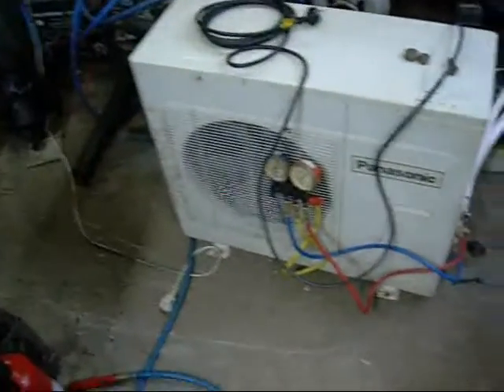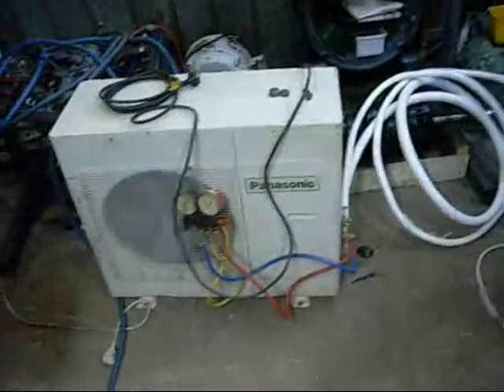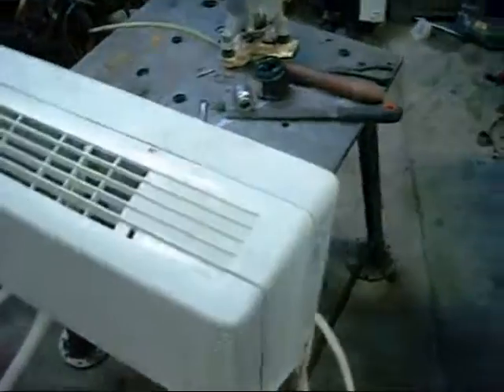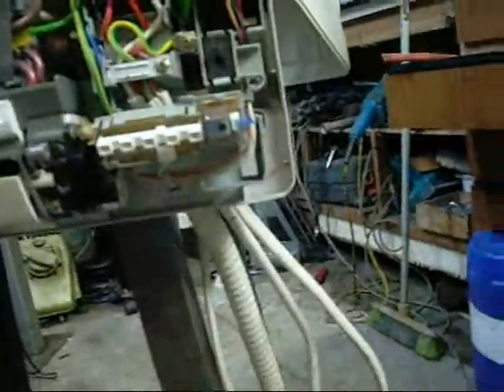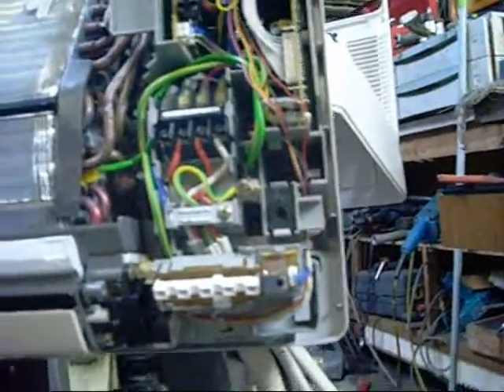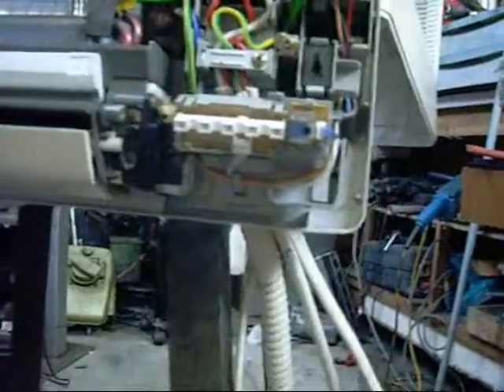This unit is still fully charged. I'm guessing they did put it aside because they wanted to use it — it was sealed up very well, fully pumped down. As long as the electronics inside here are alright, it will work again. Another good heavy-duty split system. It's somewhat dirty but still should work alright for now. I'll give it a full clean once I actually give it a pass for electrical and functionality — no point in cleaning it if it's dead. But if it shows promise of working and I get refrigerant through it, I'll clean it and give it another assessment.